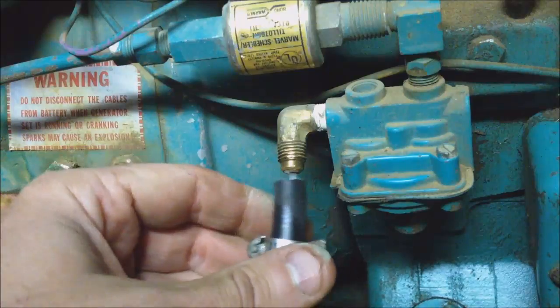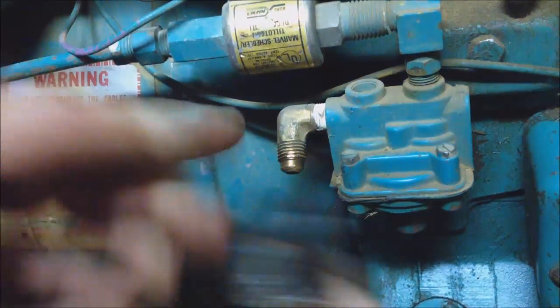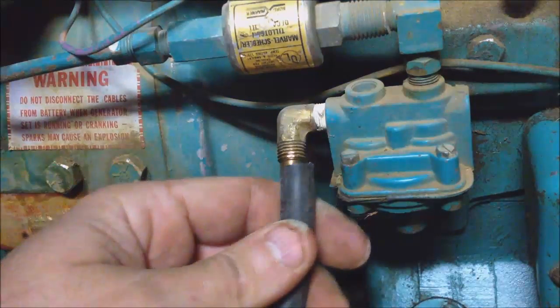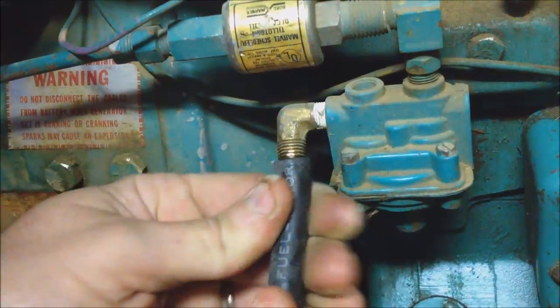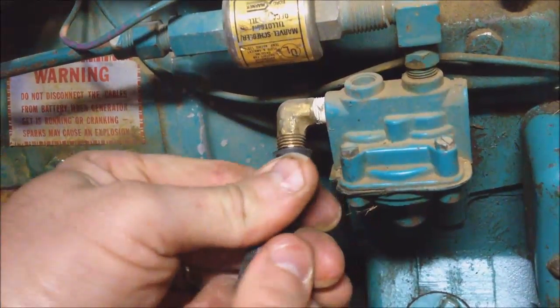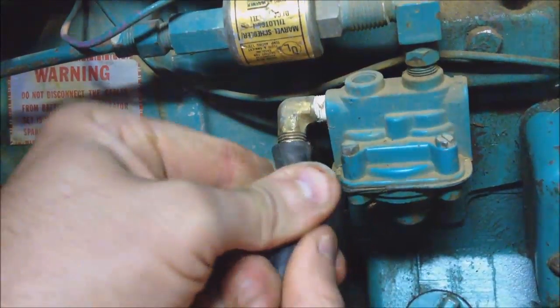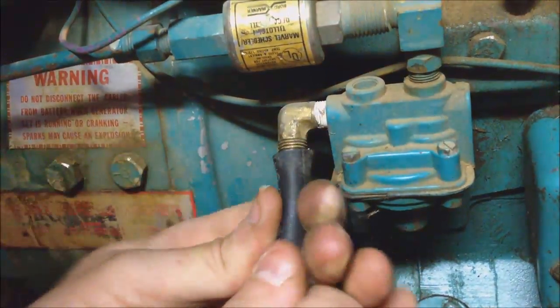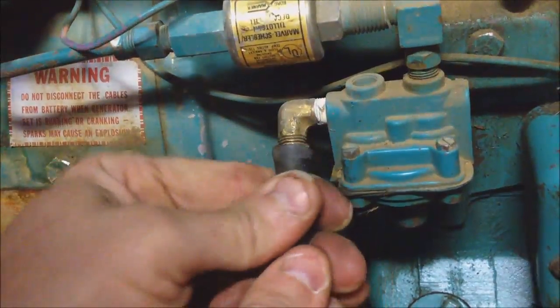So we'll take our fuel pump. This was the line that was, oh, I see the issue here. This is crazy small. Oops. No wonder it was kind of split. This is nuts. This is not the right size fuel line. It might have been for the tank, but oof. We're not going to have to clamp this, but we need to get a bigger line.